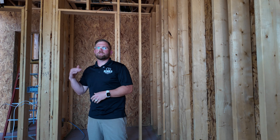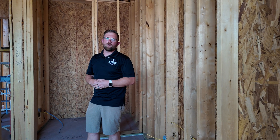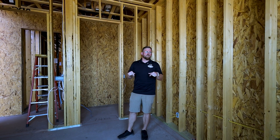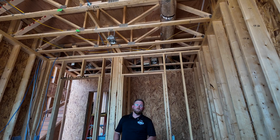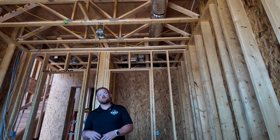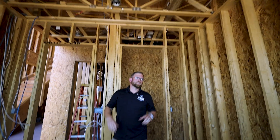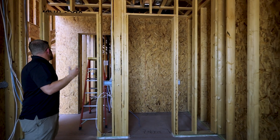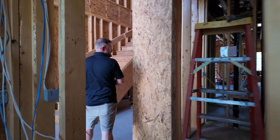Our floor trusses are 30 inches in depth, which allows us to get most of our systems throughout the home. I want to talk about the differences of some of these floor trusses as they reside on the first level. In bedroom 2, which is also an optional office, we didn't want to integrate too many design details within the truss units, since we obviously want to maintain structural integrity with the house and the bedroom residing above.